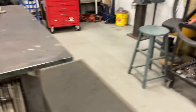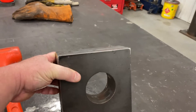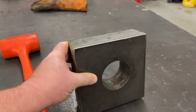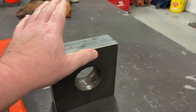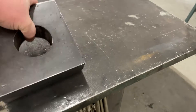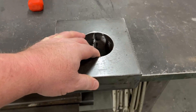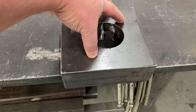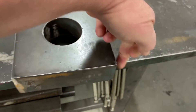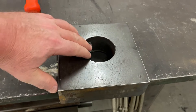Normally this is what they look like when they show up — flame-cut blanks with a quarter-inch allowance on all sides — and I have to machine all four sides. If we imagine this welding table was the table of a boring mill, normally if you're just doing a few of these you'd clamp it down, machine it, turn it, put a square on the just-machined surface, clamp it down, machine it again.